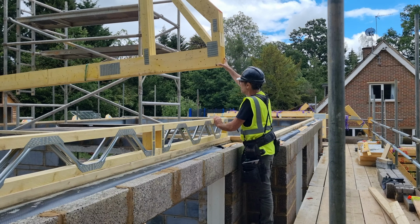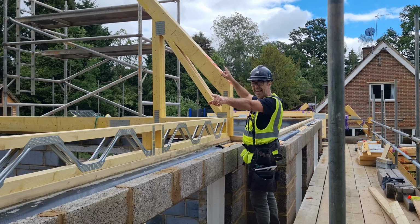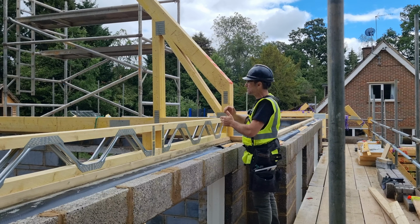If you aim to get yours corner on the corner of the wall plate, Callum, as you're going to contact first against your joist. Are you there? Yeah, perfect, mate. Okay, so that's perfect. Hold it there. So we've landed the first one. Now we're going to brace it. I've got my extra long Stabila level and we're going to take that right back to the plate because that's the most secure, especially at the corner.